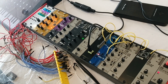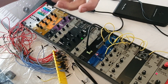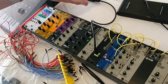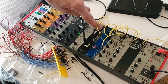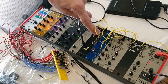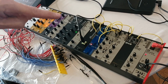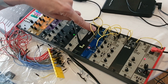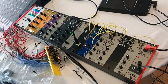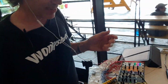So you send something on MIDI channel 1, it comes out of output 1. Send something on MIDI 2, it's channel 2. Now, the difference between this and what the master module does, for example, is this is actually still MIDI data. So it's not a CV, and so you can't just plug this straight into an oscillator. However, because it's still MIDI data, this one wire can carry polyphonic information, so you can hold a chord. Not in this demo, unfortunately, so sorry.